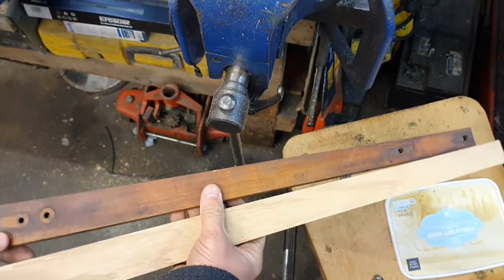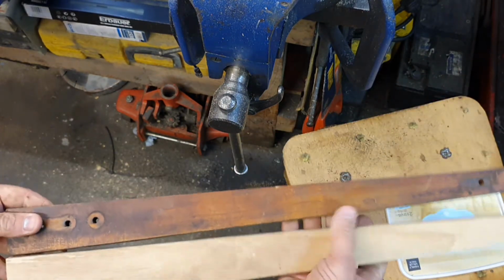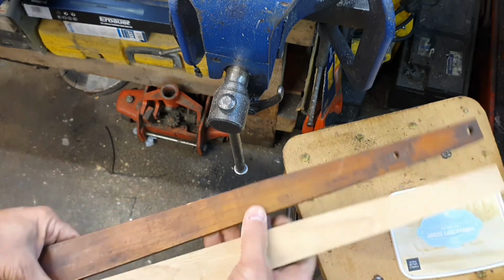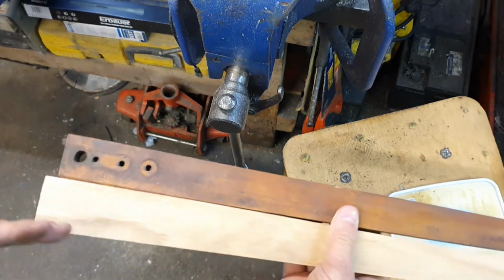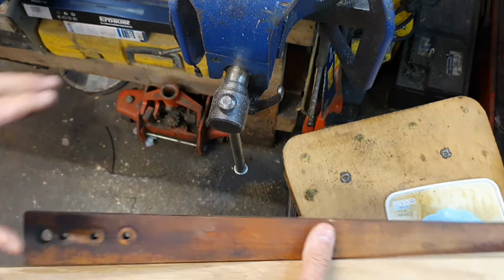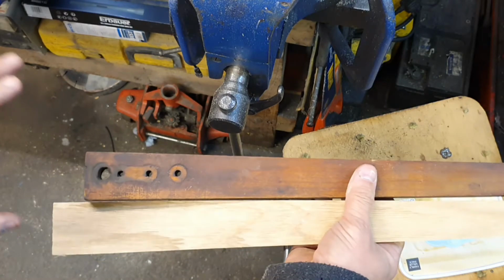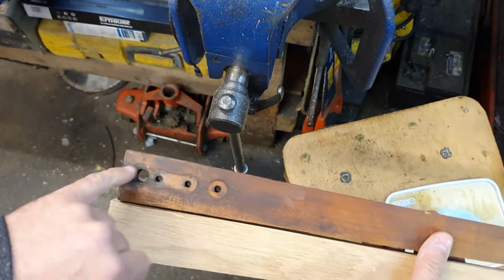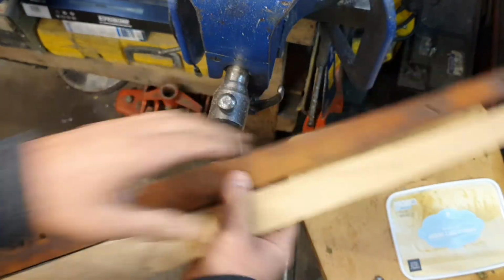And here we go. The new arm. The overall sizes across there are the same as that, well, near enough. And at the front, length the same. But instead, there's the same taper on each side rather than just on a single side. I'm a bit dubious about transferring the holes across from there to there until I get the machine back in one piece and we can measure where it is, because they're such poorly drilled holes. It might make the blade out at the end.